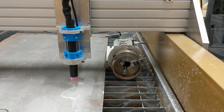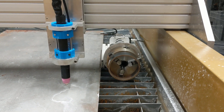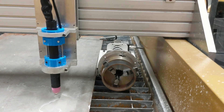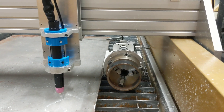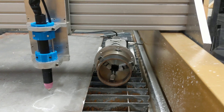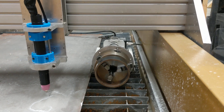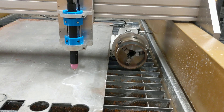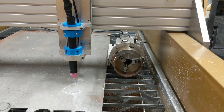Everything seems to be working. I've still got my X axis controlled here — I've essentially swapped it with my A axis — so I can still jog this one, and I can rotate the A axis by controlling the X axis, if that makes sense. I've still got full control over the machine. This is just a test — essentially I'm asking it to cut two holes in the pipe at either end.